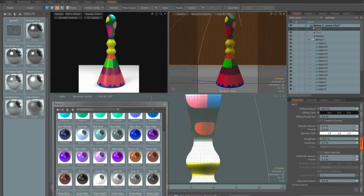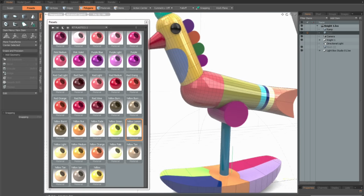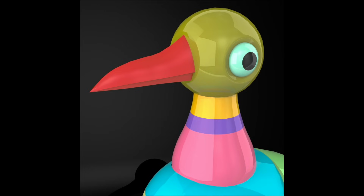While I was doing the CAD work, I also had to do the renderings. So I exported the models via the OBJ format from Rhino into Modo and did the renderings in there. I just used a hard, shiny plastic material, and that worked out really well to give the final renderings. These were used to show the client, to visualize what they were going to look like when they were finished, and also to work out some of the colors in advance.